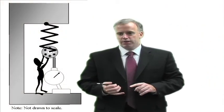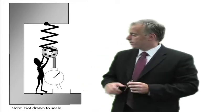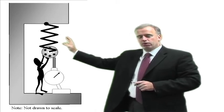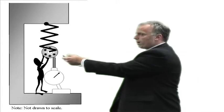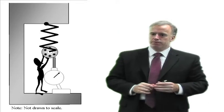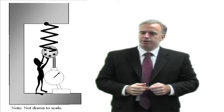There is a very simple way to measure the stiffness of your wheel head. Get a clock or a dial gauge and put it on the spindle, or if the wheel is still on there, put it up against the wheel. Then pull up on the wheel, or if you want to be a little more accurate, get a spring scale and pull up on the spindle that way.